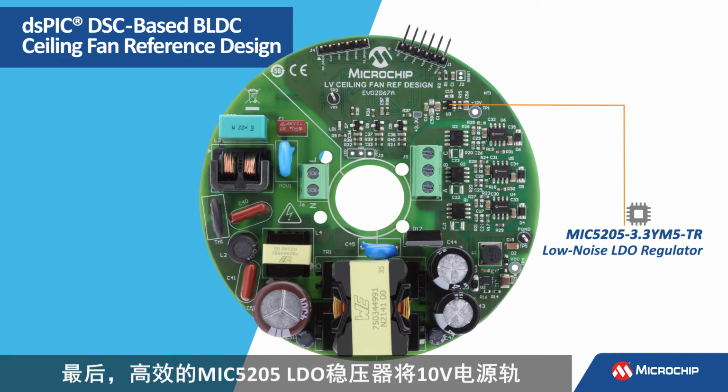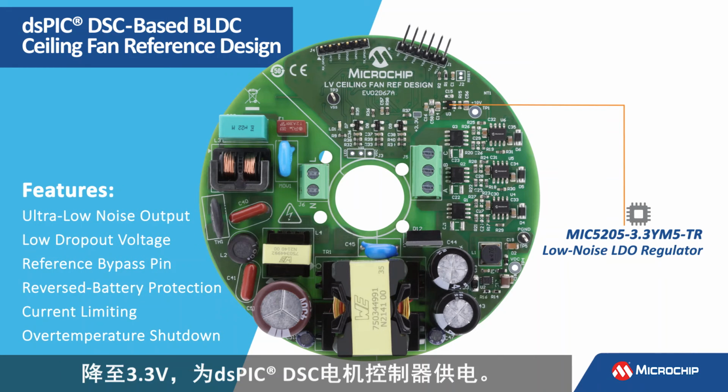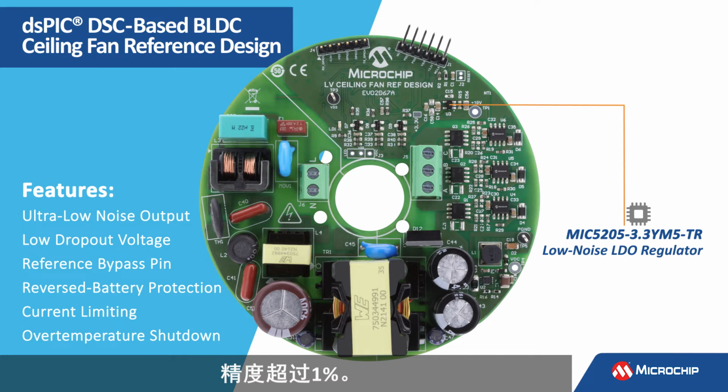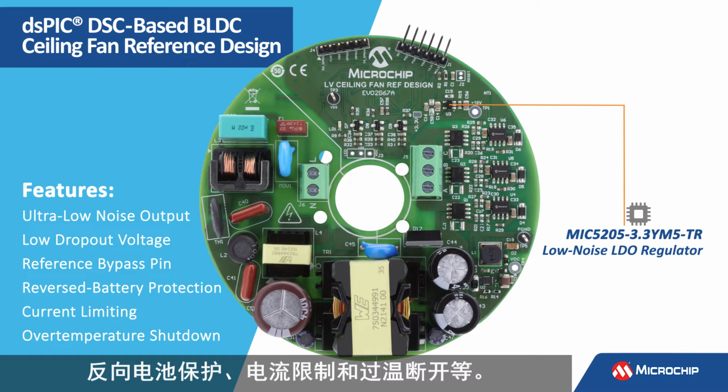A highly efficient MIC 5205 LDO voltage regulator drops the 10-volt power rail to 3.3 volts to power the dsPIC DSC motor controller. The MIC 5205 has an ultra-low noise output and a very low dropout voltage, offering better than 1% accuracy. Other key features include a reference bypass pin to improve its low noise performance, reversed battery protection, current limiting, and over temperature shutdown.